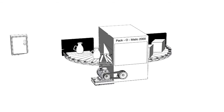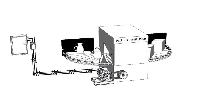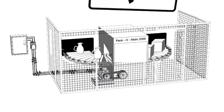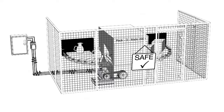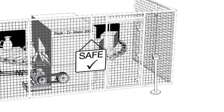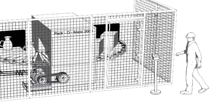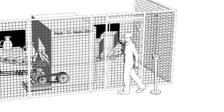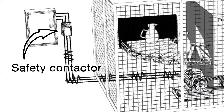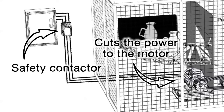Machinery designers have always engineered safety into their machine designs. And now more than ever, legislation puts the onus on the designer to show how and to prove it. Normally you'd have to fit an emergency stop button and sensors that react if someone comes near a machine or opens a safety cage door. It's common for these sensors to trigger a safety contactor which cuts the power to the motor, but these have some drawbacks.